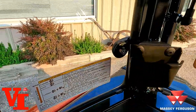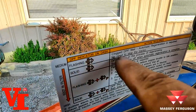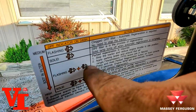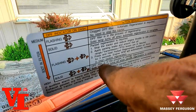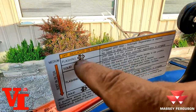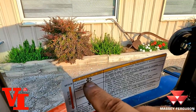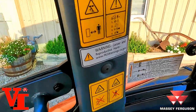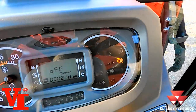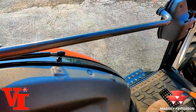There's a cell phone holder right here. If you've got any questions on the diesel particulate filter, there's a decal right here that shows your status lights and what you need to do: flashing means you're in the process of regenerating, and a solid light means the DPF is doing a park regen. The faster you can get it cleaned out, the less stopping you have to do. My advice: when the light starts flashing, keep on working and let it do its thing.